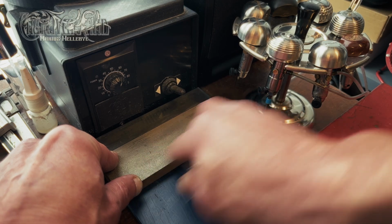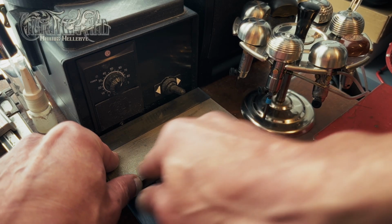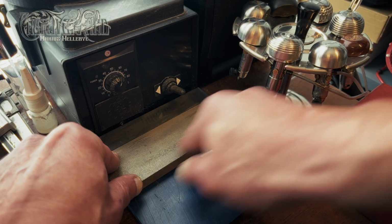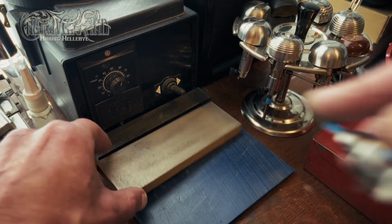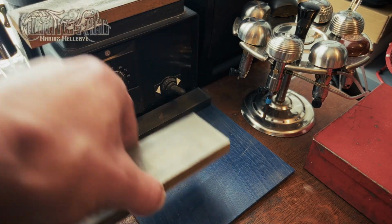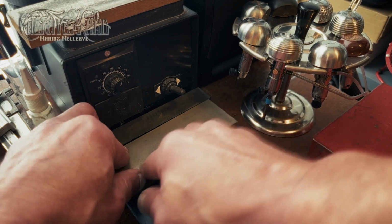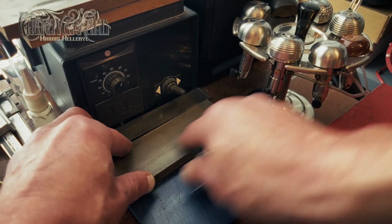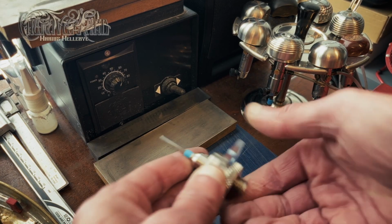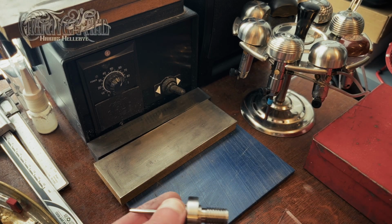Here I start with the 600 grit stone, then the 1200 stone, and so on before I polish the graver. So remember, first the belly on the small template, then the two upper sides and the top. The tiny stone you see close to the power hone is a ceramic stone for high polish, but that's for another video.